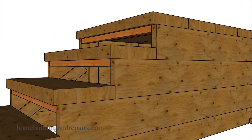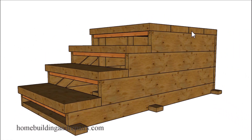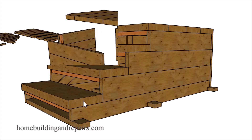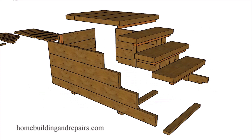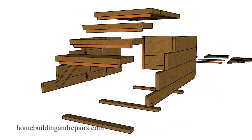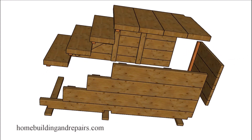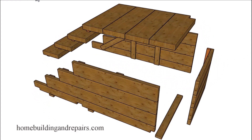I have this same stairway designed with 2x12 treads and 2x12 decking. However I don't know if that's going to be strong enough for your project, so you can always make it a little stronger by adding thicker lumber. Let's go ahead and separate the stairway into a couple of sections because we are going to be assembling some of the stairway in sections.